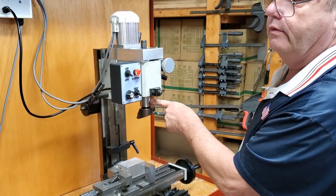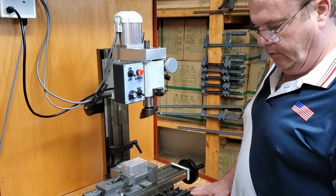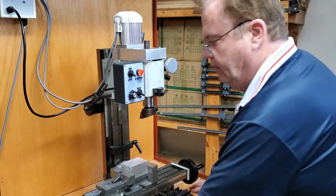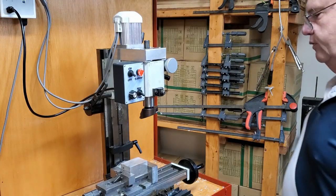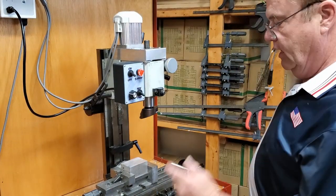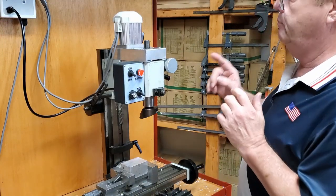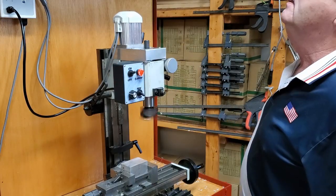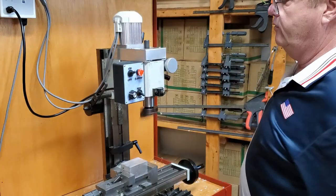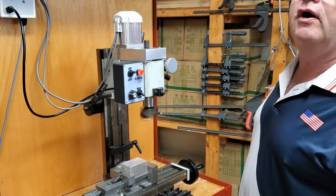In the spindle, and that thing is expensive to replace. This machine is also only bolted down to a piece of half-inch plywood. The stand is stable and locked with maybe 50 pounds in the bottom, but I really should put in metal braces to stabilize it, because these cutters are also out of balance.